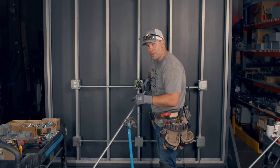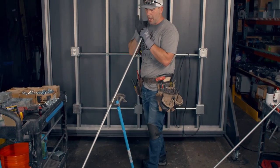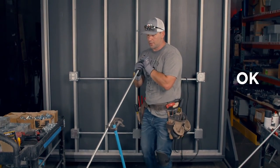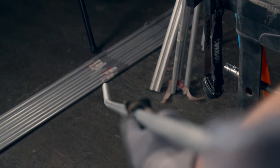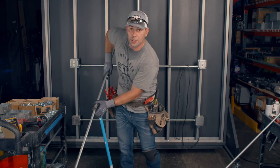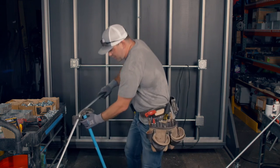If you do not rotate it 180 degrees, it will go up and kind of curve at an angle — that's called a dog leg. You rotate it 180 degrees, line it up with the arrow, lean back, and look straight down the pipe. If it's not 180 degrees it's going to look off to one side; if it's too much it'll go the other way. You want it right at 180 degrees so it doesn't dog leg. Once it's lined up, you bend it — hold it in place and come down until it hits that 30. Boom. It's bent.